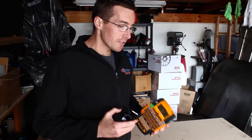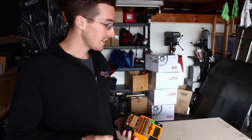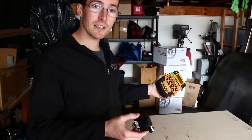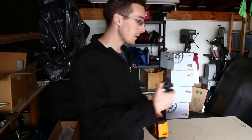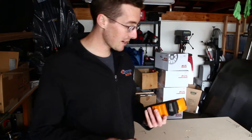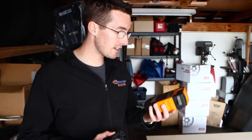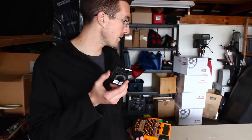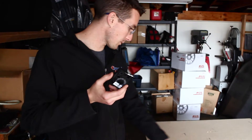Good innovation here in the garage with blue painter's tape — patent pending on that. An important step when laying out each wire is you need to label it. We're going to have a lot of wires on the table, so we're going to do it the right way — label the beginning and end of each wire so when we're constructing the harness we know what wire is what and don't get something crossed up. We got this Dymo label maker off Amazon, and the cool thing is you can get cartridges for it that have heat shrink tube you can print on. This is going to make labeling the harness a lot quicker. Ryan's developed a coding system on his sheet so we know what wire is what, what color it is, the wire number, gauge, and where it's going.